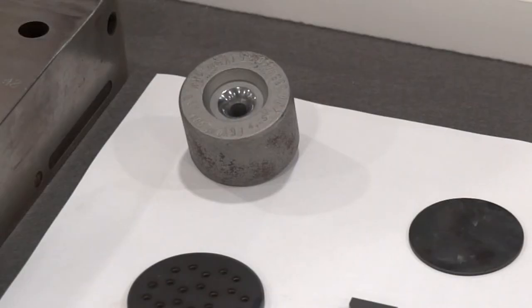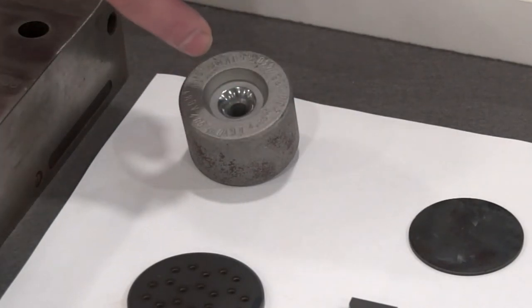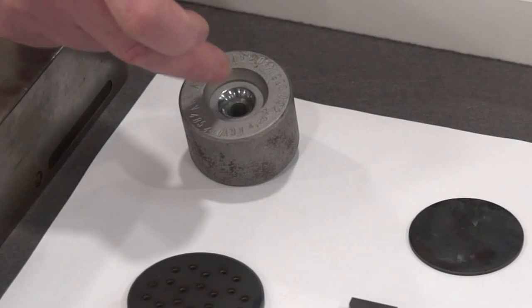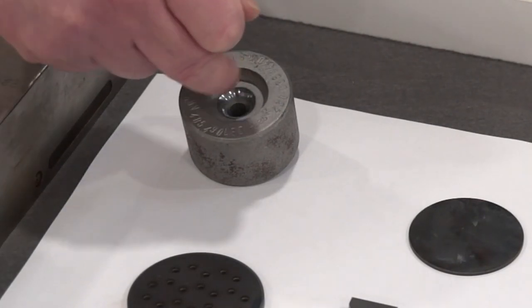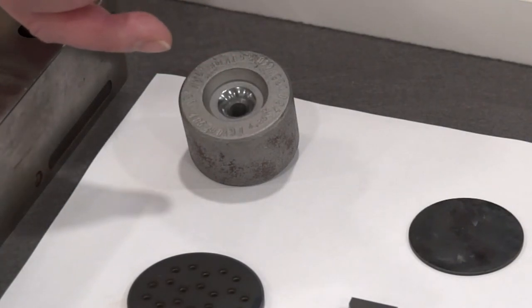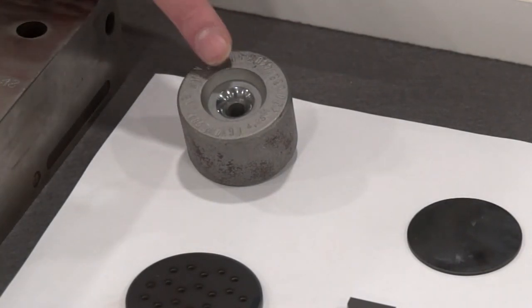What are these smaller parts on the end? The smaller parts represent the more exotic materials. Carbide, being the first one, is becoming more and more of a standard. Here we have an example of a roping die — a steel outer body with a carbide insert. That carbide insert would first be rough EDM'd with copper tungsten electrodes, and then finished down to a surface finish of around 0.2 RA, before probably having the final polish in.